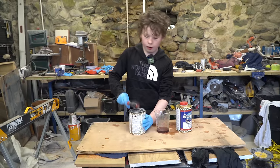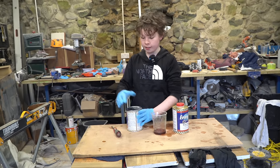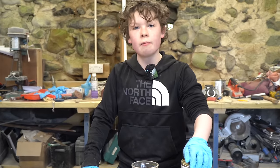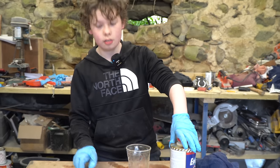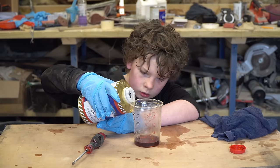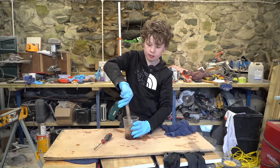Having put the lid on, apparently it's supposed to turn the varnish tin upside down so the varnish inside seals the lid, which stops it from going hard inside. I need to pour in an extra 25 millilitres of thinners to concoct the magic potion, which will seal our washboards. I'm going to give this a little bit of a stir, then it'll be ready to go.